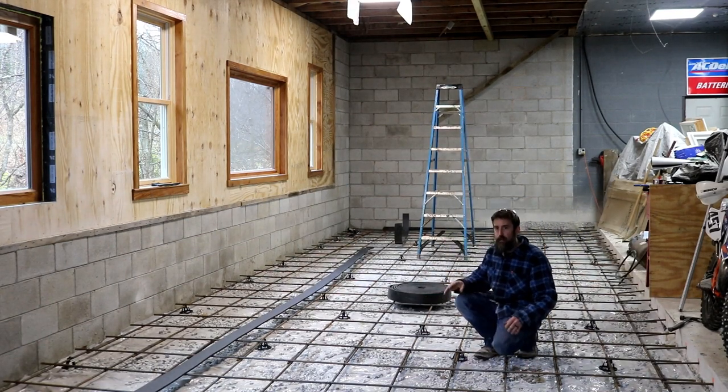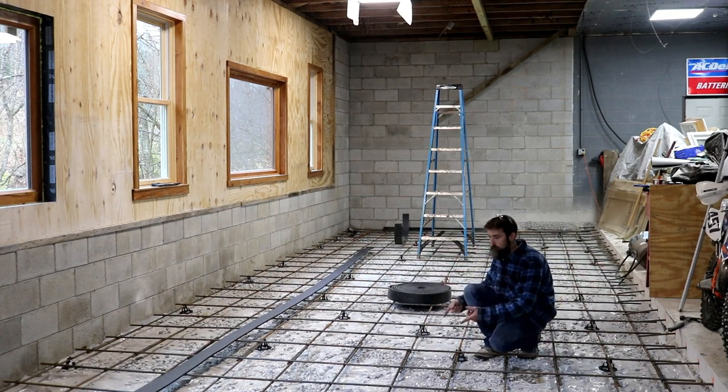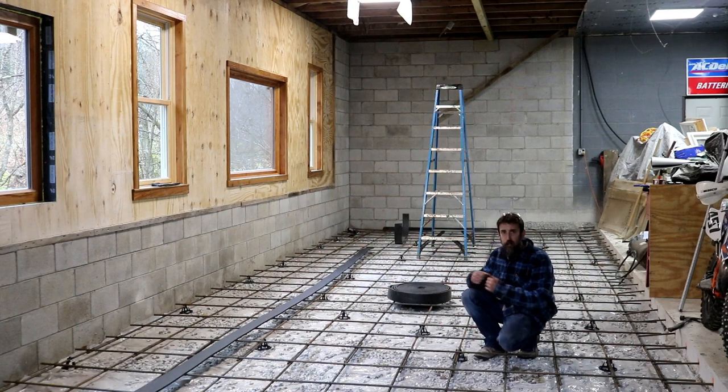So concrete's expansion is very similar to steel's expansion. That's why you can put rebar into concrete and they don't tear each other apart due to temperature changes. And I know that steel, on average, expands about a thousandth of an inch per 100 degrees Fahrenheit, in all directions, right? So an inch block of steel, raise it 100 degrees, it'll expand to a thousandth of an inch larger than what it was.